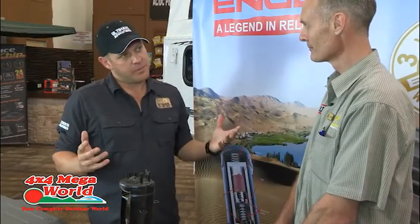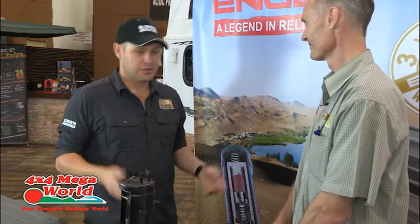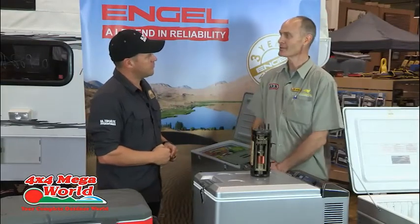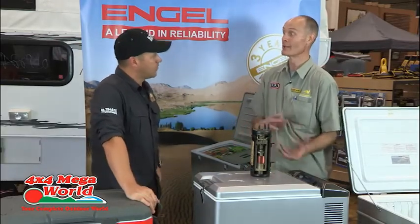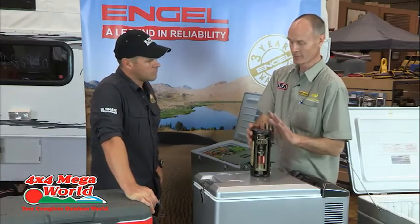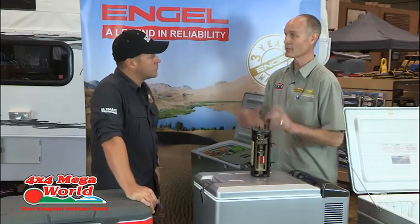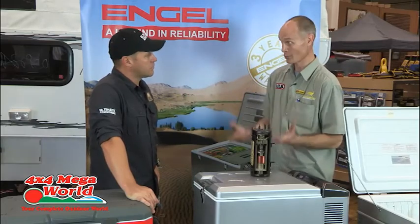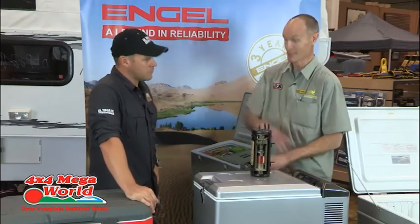I'm new to this whole off-roading 4x4 game — I've been using a cooler box for years full of ice. Now I want to head out into Africa where ice isn't always available — sell me a fridge. It's an interesting conversation because the technology of a fridge doesn't really lie in the box or the switch — it's the compressor, the end-all and be-all of a particular fridge. The Engel is the only fridge in the world that has got a swing motor. Sawafuji Japan realised 55 years ago they needed to make a compressor that could work while being shaken and at different angles without affecting its lifespan or ability to cool. Irrespective of what size Engel you buy, that is what makes it an Engel — this thing called a swing motor.